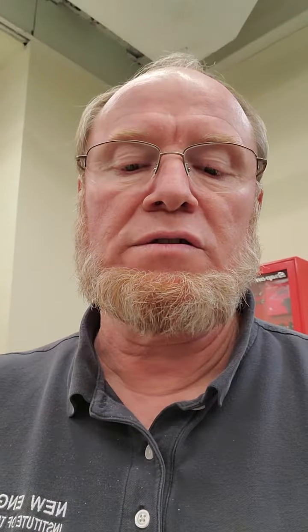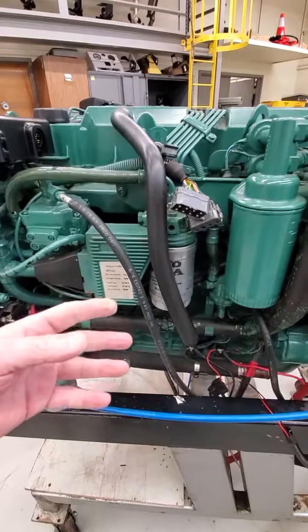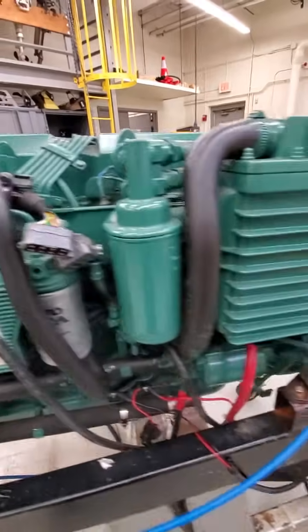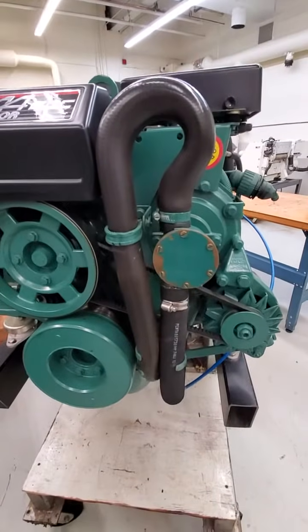On the newer EDC engines they do have a temperature sensor. Over here I've got a KMD 300 — this is the EDC version, the six-cylinder big brother to the three-liter; this is the four-liter version. You know it's an EDC engine because it's got the processor on it. This engine has boost pressure sensors and boost temperature sensors, so it will set codes for those as well. If you want to check boost pressure against the sensor, you could do the same thing — they have the same plugs in them, which is really nice. And here's the same raw water pump used on this EDC engine.